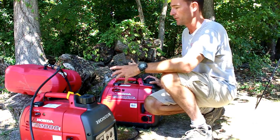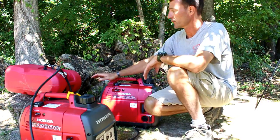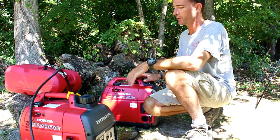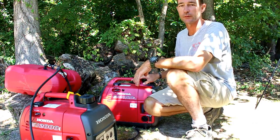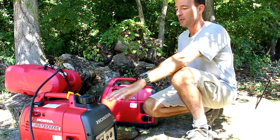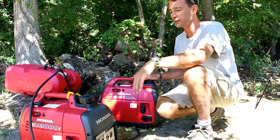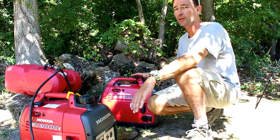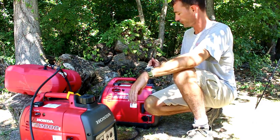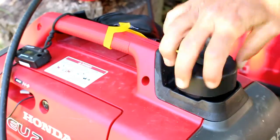When I'm out dispersed camping, this is my setup. I have my Honda 2000 inverter and my Honda companion. What I do is set up the six-gallon gas tank elevated slightly above the two generators so the fuel flows more efficiently. One time I had the fuel tank on the ground and one of my generators ran dry — but I was still running and still had electricity because the parallel cables were attached. So if one stops, you still have at least 2,000 watts. Make sure you try to elevate your gas can first. Now I'll take off the fuel cap on both generators.